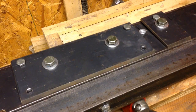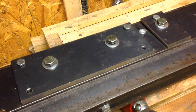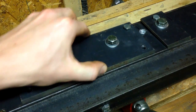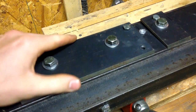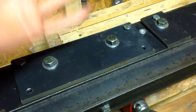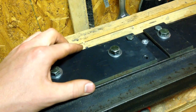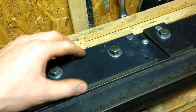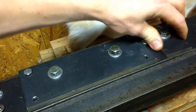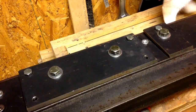Next thing I would do is drill the holes more precisely to the size of the bolts. Because I drilled all these holes oversized thinking that way everything would go together nice and easy. Well, what happens is you get all this backlash, which unfortunately makes it so you can't get repeatability in your bends if you don't know exactly where this is along the sixteenth of an inch of travel it has. This one here is much worse — look at that. I use a framing square every time I tighten this down to make sure it's in the same position, which is a pain in the butt.